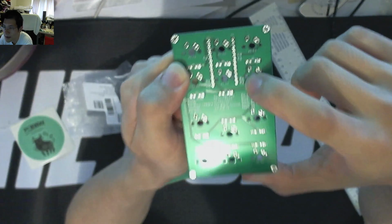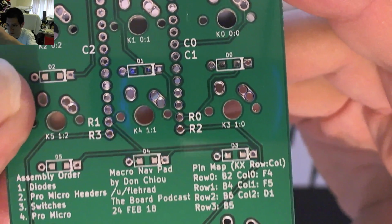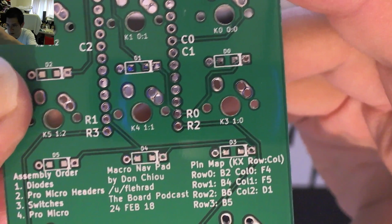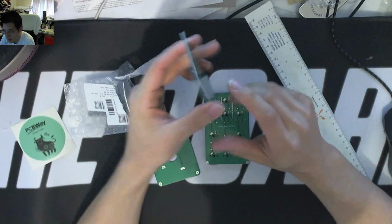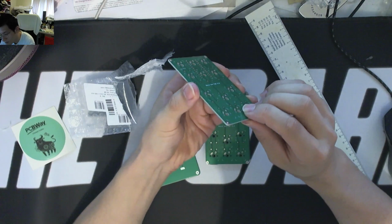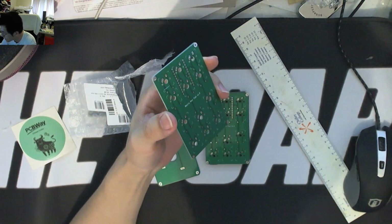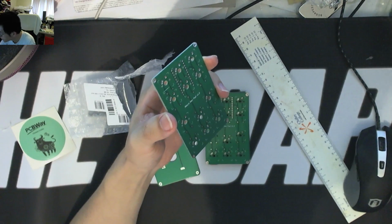You can kind of see they do run quite thin. On that particular pin placement, I've been able to successfully run it really close to the through hole for the actual foot of the switch. So there you go, it's pretty nifty. Rounded corners, there's no obvious weird bits, and I didn't forget my solder mask this time, so I didn't end up with some horrible dodgy thing.